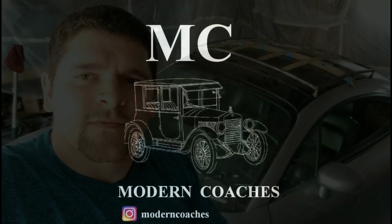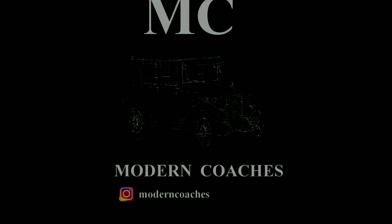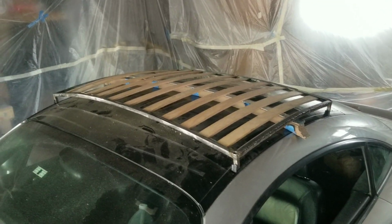What we're gonna end up doing is I decided I will show you guys how I'm going to make sure that these planks of wood actually stay curved. Starting from when I cut them, I'll dip them in the water so that they can get saturated, and that way they'll be easier to bend. We'll stick them out in the sun, and that way when they dry out, they'll sit curved. So that's kind of the idea right there.